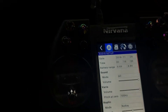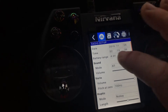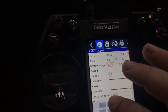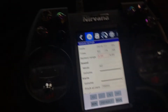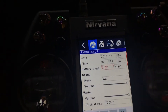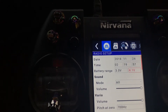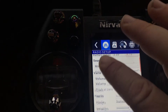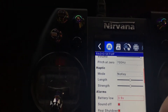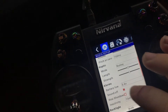Now let's look at the controller — I'll show you what I mean about the batteries. Go to that center icon again. It's showing 4.6 volts for the low and 4.8 volts for the high after the update. We've played around with it — some UFPV pilots and I have gone back and forth from 3.2–4.2, 3.2–4.1, and we're doing really well running 3.0 to 4.1. Set that now. Go down to Battery Low and set it to about 3.6 volts. Also turn the RSSI shutdown off.